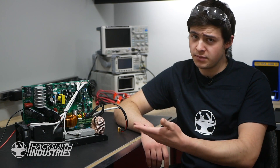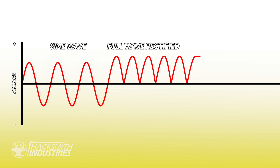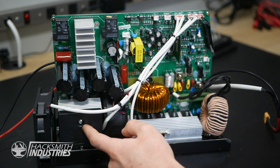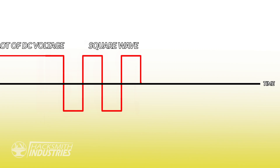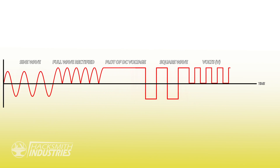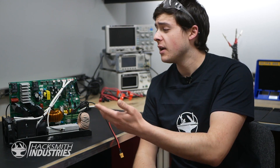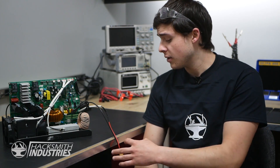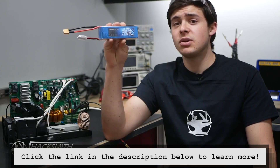Now that I've got the plasma unit disassembled, I've done some reverse engineering and I think I figured out how it works. We start off with an input of 240 volts AC, which gets rectified and filtered into 288 volts DC. Then we use an IGBT H-bridge to create pulsed AC, which passes through a 3-to-1 toroidal transformer to step up the current and step down the voltage. Finally, that gets re-rectified into pulsed DC and output to our plasma cutter nozzle. Theoretically, we should be able to bypass the entire AC system and feed it 288 volts DC directly. To do that, we're going to be using 12 Tattu Gensace lithium polymer batteries in series, giving us 288 volts DC.